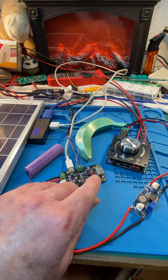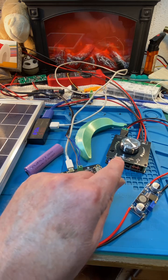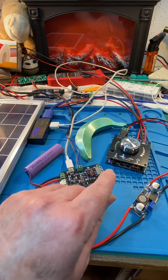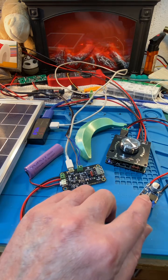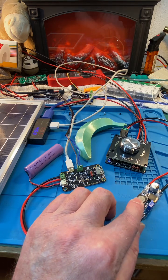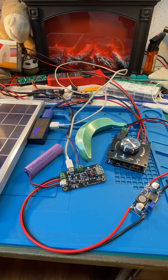Now this could take five volts, but it's not enough current for the audio system — five volts is not strong enough. That's why I'm using this boost converter, which will give us an amp quite happily and powers the audio amp without issue. So that's it — there's your solar-powered Bluetooth player.